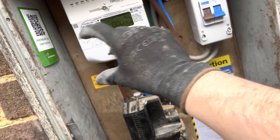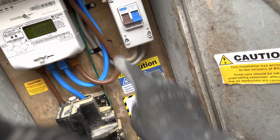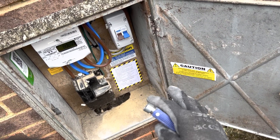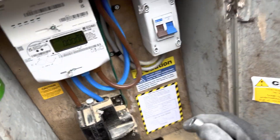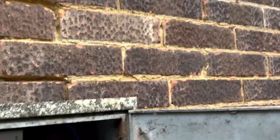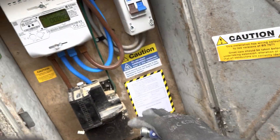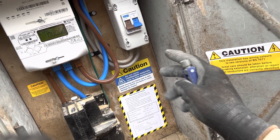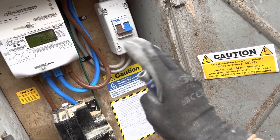Before, it was one of those really old black single-phase ones — they're tiny, about that big. So I thought, smashing a switch fuse here, armour cable out of the bottom, and round and up. Didn't know that was going to happen. Very quick change of plan this morning — I can't move it where you want to go because I can't install the switch fuse, it just won't fit in there. So I suggested: we can't move it more than three metres, and that's why it's going to go just above that door, just below the door frame — about two and a half metres.